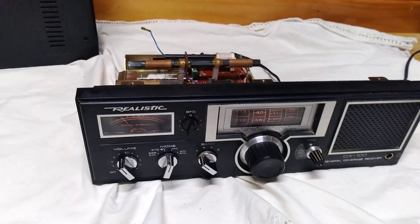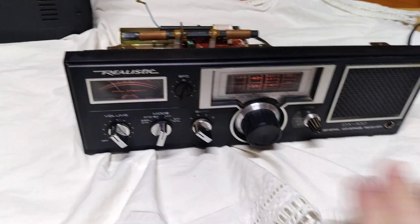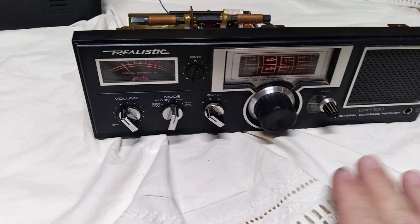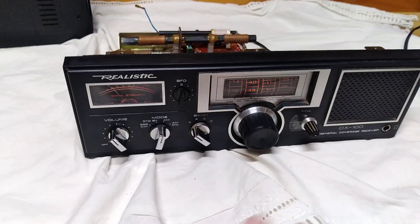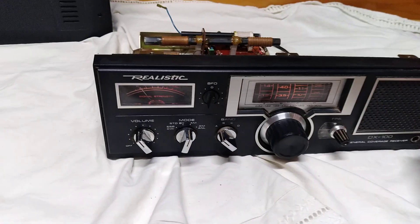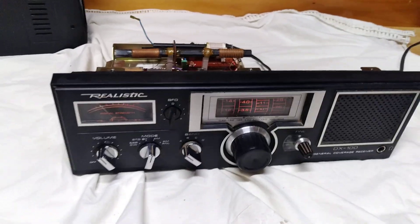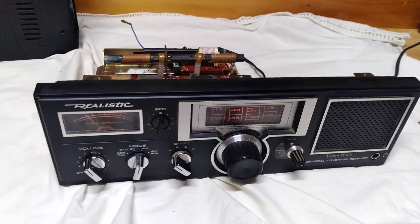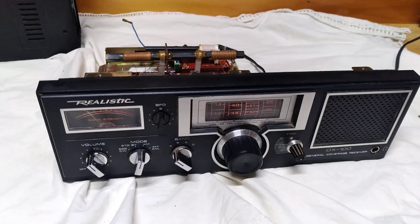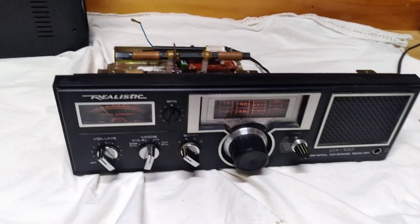This radio is, I think, one of their finest radios. It's very basic and very easy to run. It doesn't have FM — it's got AM and three shortwave bands all the way up to 30 megahertz. It's an awesome radio if you don't want to spend a lot of money. It runs on 110 volt or a CB-style 12 volt. You can hook this up to two 6-volt lantern batteries hooked together and run this thing for days and days on a couple of batteries. So it's a great radio to have.